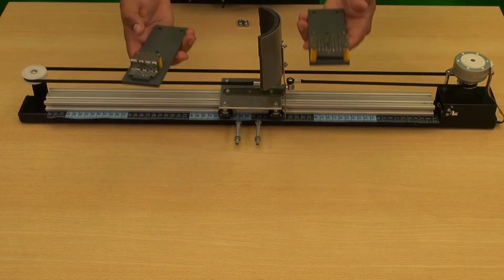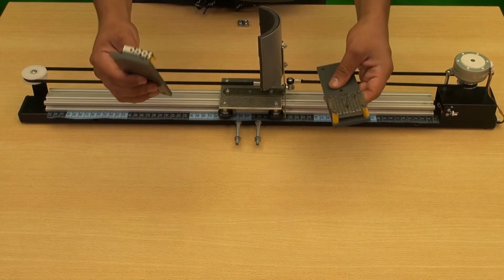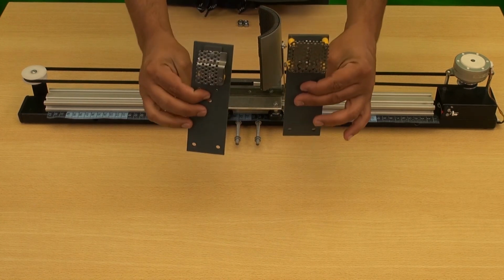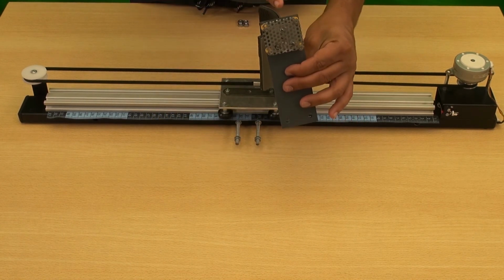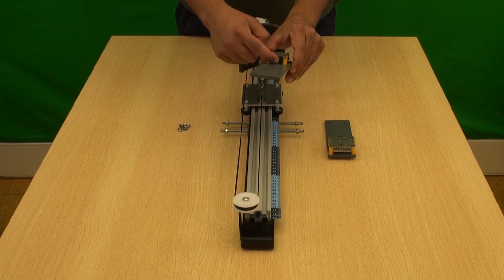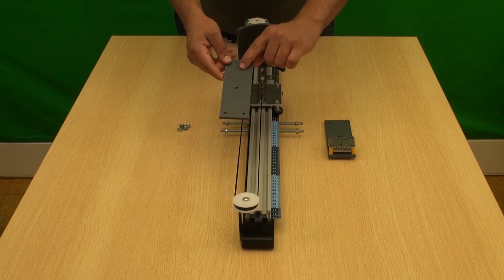The two brackets with the sensors correspond to the laser on the right side and the photo gate on the left side. Attention! The new versions have protections to avoid damage to the electronic elements. In the photo gate, besides the protection, the electronic cable enters from below, and on the back side we have a pinhole where the laser will aim.